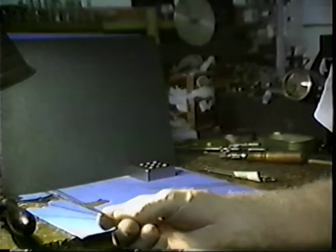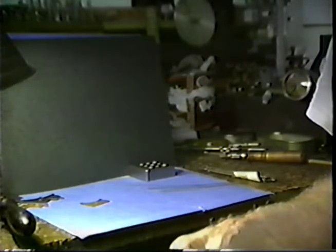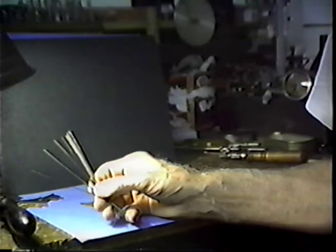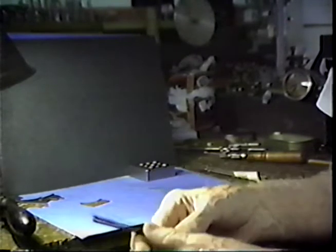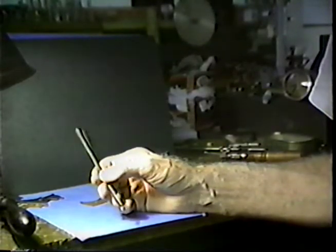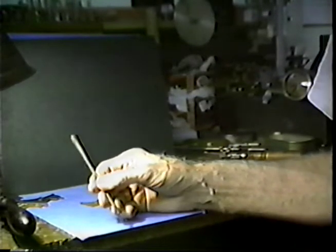There is a very good reason for learning to use the mid-range blades. One is the economic aspect of not having to have as many sizes. A coarse blade cuts a wider curve, requires more effort in sawing, and is more difficult to guide to a close cut line. The smallest blades have uses for specific applications, but are so delicate that the breakage rate is pretty high if you are cutting fairly substantial thicknesses of material or attempting to cut very fast.